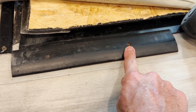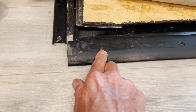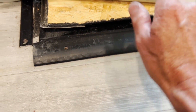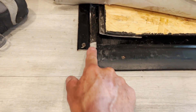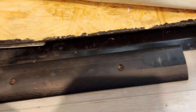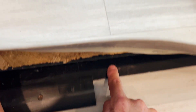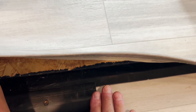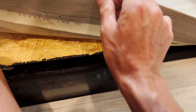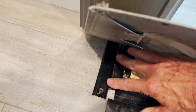You may have to take these up and reposition them. On ours, there are two pretty long, heavy-duty number two Robertson square-head screws — one here and one here — and you can see they're recessed. Just take your drill, screw them out, move the wear bar over until it's completely outside of your slide ski, and screw them back down. Part of the wear bar goes over this metal bar here, over the top — that keeps the metal bar down. This metal bar has a break in it, and that's what helps the slide pop up as it's coming in and drop down into the hole with these flush slides. You can go as close as touching the next bar but not beyond it.